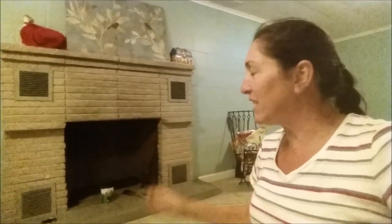So one of the interesting things about this fireplace is it was not built with limestone like a lot of the fireplaces of this era were built. It has like a 2 by 12 or 12 and a half. It's almost like a patio block with a cut edge, and it's a little different. Because of the way they did this, I don't know that I'll even be able to put a fireplace door on it, but at the very least, I'll be able to get a fireplace screen.